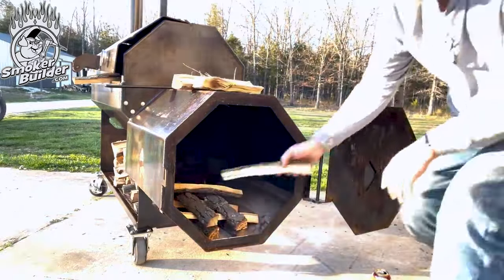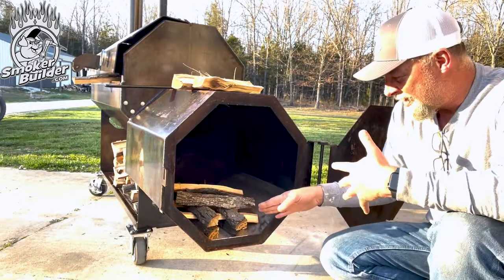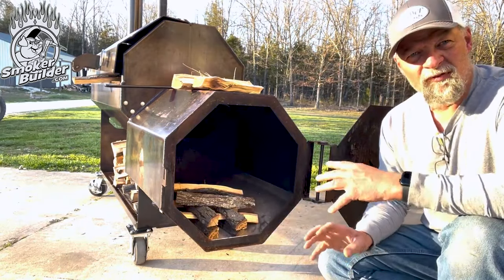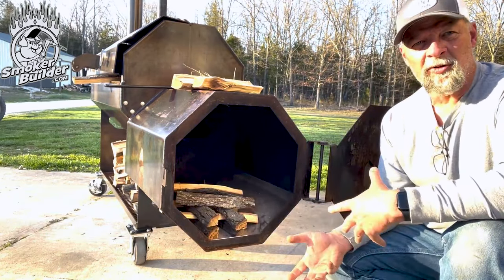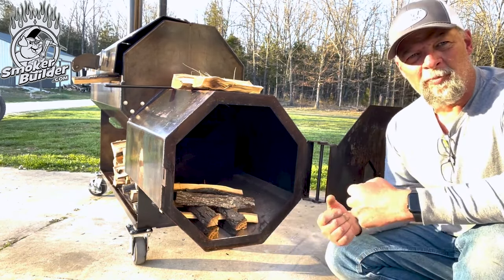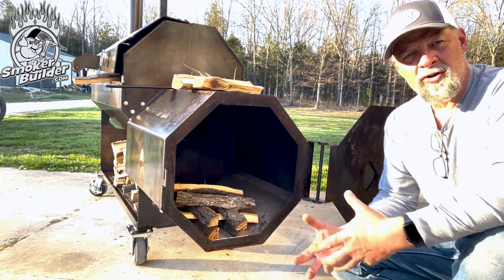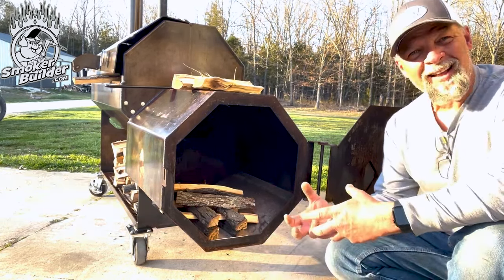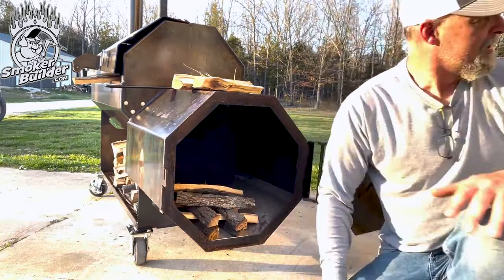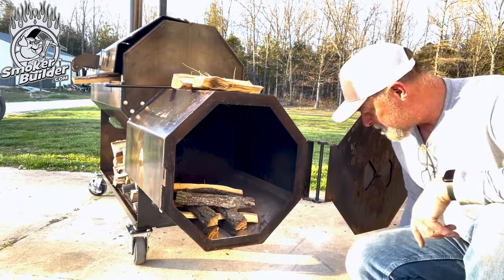I'm going to go get one more stick and just stair-step this thing up a little bit. Now, one of the secrets on these torches — if you've never used one before — there's a BB, a little safety check valve inside the valve called an overflow protective device. Inside the stem on that barbecue bottle, when you open it too fast, all the hose fills up full of gas. The BB closes it off because it thinks the bottle's just blowing wide open.